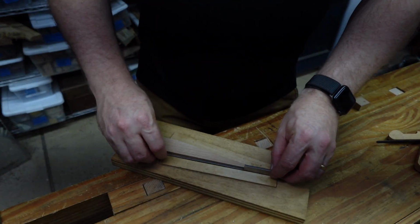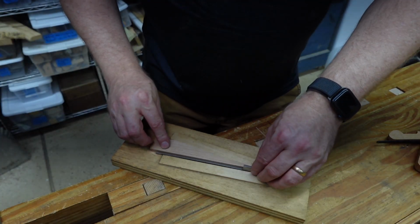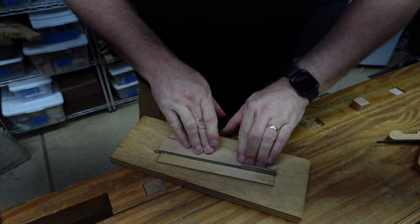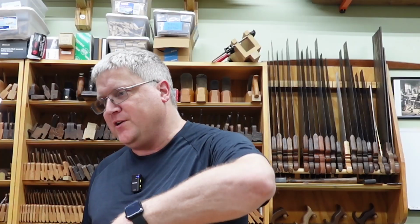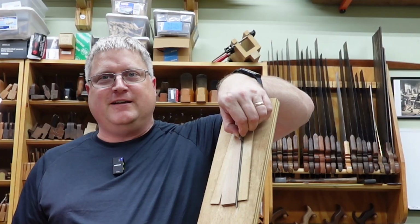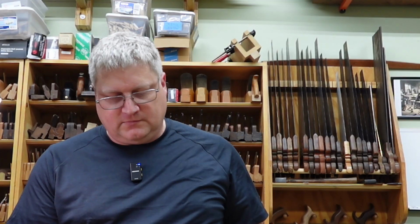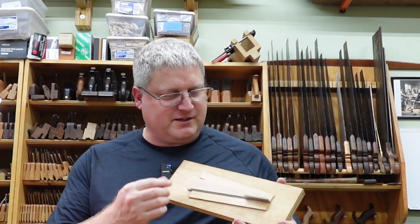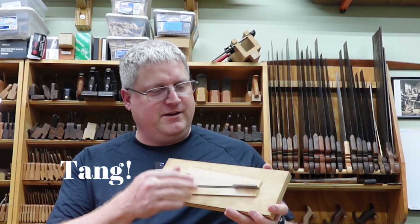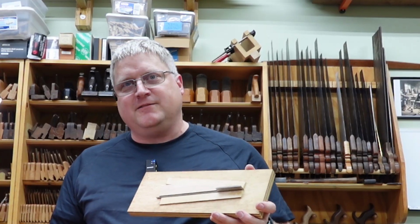So when we want to hold the iron in place, we'll tap on the wedge here, push it in a little bit, and before you know it, you've got something that's really holding on for dear life. So the nice thing with this opposing wedge setup is, since it's a sticker, if you tap on the finial here, it'll all just come right out easily.